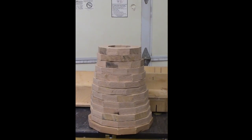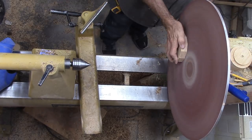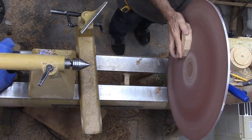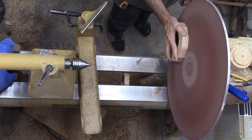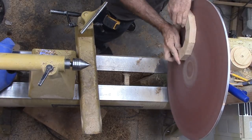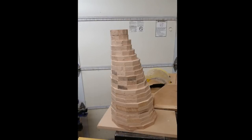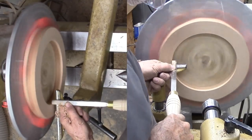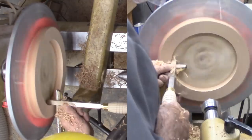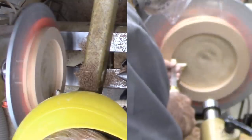One problem is keeping track of all the rings — for this picture, I lost track of the two smallest rings. I use a thickness sander to clean up the rings; however, I have to flatten one side first. With 10-inch rings, my 20-inch sanding plate on the lathe is handy. I don't use it much because momentum spins it off when I power down unless I am very careful — I need to add a set screw. Sanding is just plain tedious but has to be done.